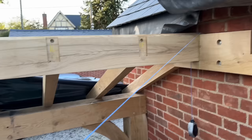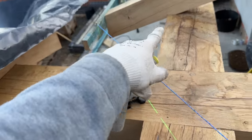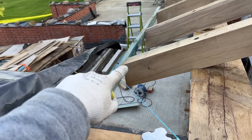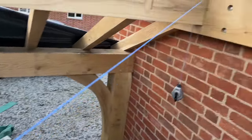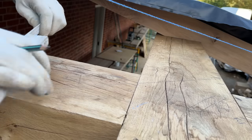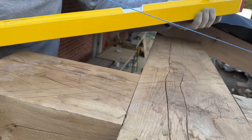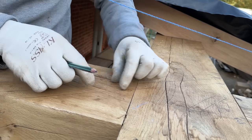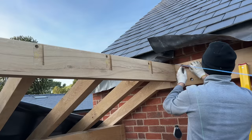So we've got a really tricky valley cut to do. We've got a different pitch here to here and we've got a different length roof — pretty interesting. It's not going to land in the corner of the wall plate or the wall beam. What I've done is just extend the rafter along on the top edge of them, put a pencil line where the top edge of these is going to come into it. I've set up a string line, but you can also use, as I've set up, a laser. Pencil these on, draw them through with a ruler — that's my centre line. My valley board is 49 and a half at the minute; I can mark that on either side of that line. That is exactly level where my valley rafter is going to sit. I've set my string line just the same amount above that line as that one up there, and I'm going to use that line to set my levels.